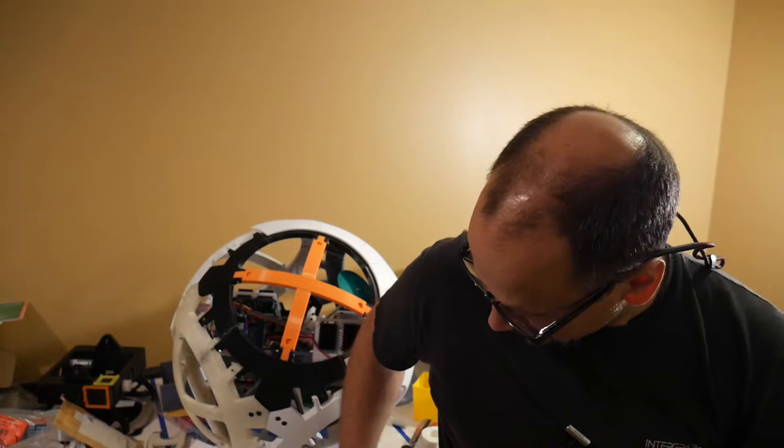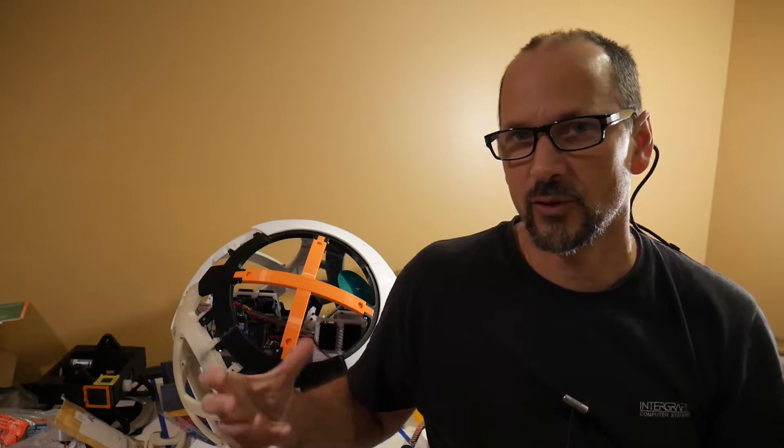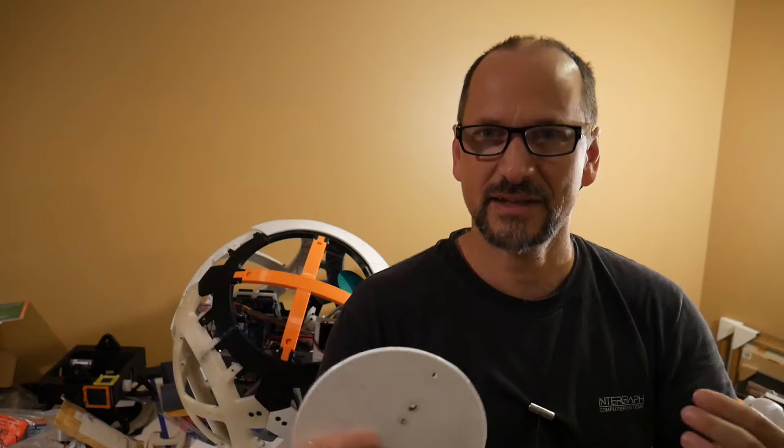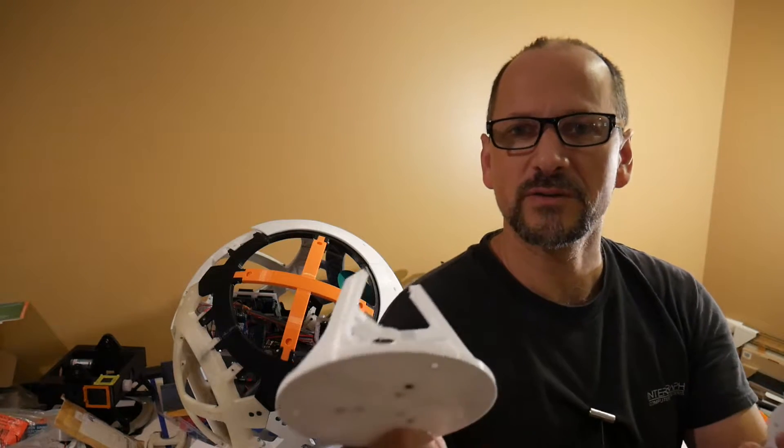My design is based around this kind of hub where the robot has a single axle drive. Unlike other designs — or actually kind of like the red carpet design — there's a hub that extends from the sides toward the middle. This is basically an axle that spins with the sphere, not with the inside. Mine's split in the middle to leave room for the head, and I rely on these hubs to cantilever everything out. The issue is these need to be really strong — stronger than I first imagined.